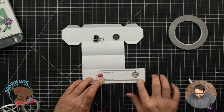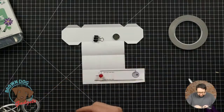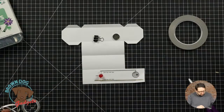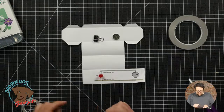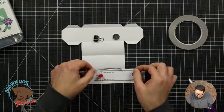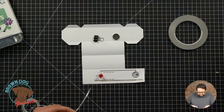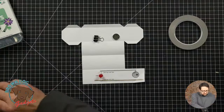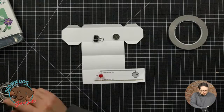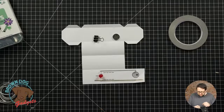That's because that adhesive bottom makes a nice connection, whereas that copper foil stuff people typically use doesn't have an adhesive bottom. Well, you totally could use copper foil tape for this project as well. It's just easier with the maker tape. You just have to make some minor adjustments for that copper foil stuff. But yeah, the maker tape's strength, durability, flexibility, and that conductive on top and bottom approach just makes it way easier.